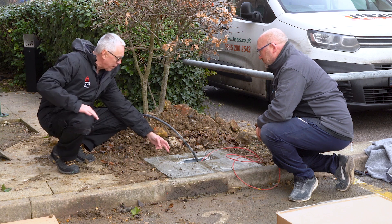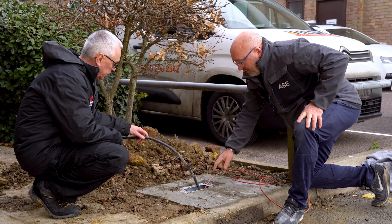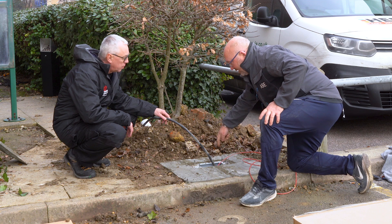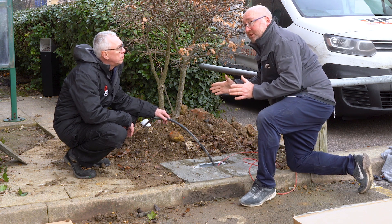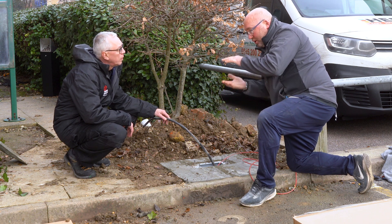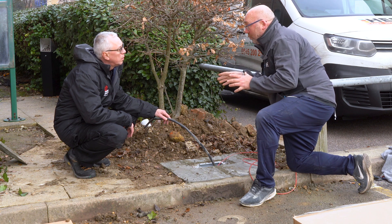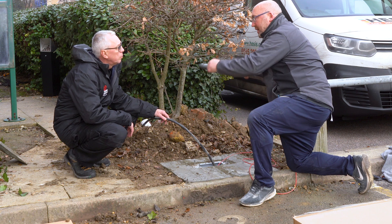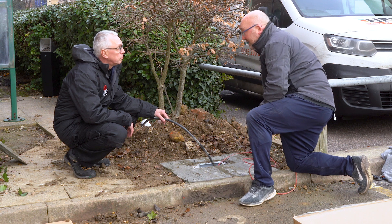Why the ridge here? What we do there, as you can see on the previous one, we have a little ridge because the routing kit is a certain size. The base of the unit is quite a lot bigger, and if the routing kit matches up there it means the stability of the base is that much smaller, whereas where it's below now, the base of the unit is where the stability is created and you're now bolting down onto that.